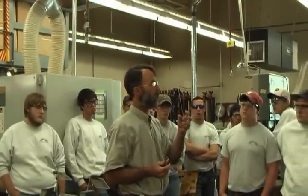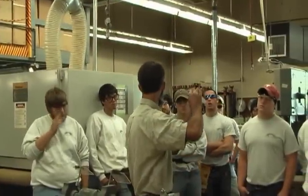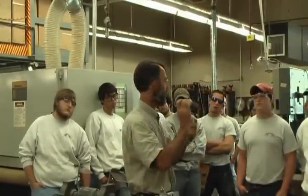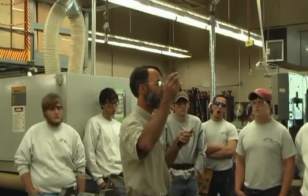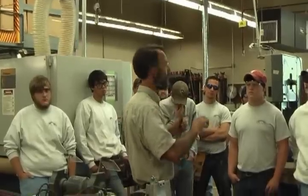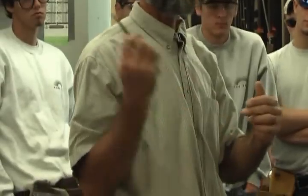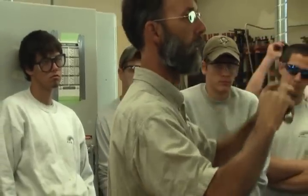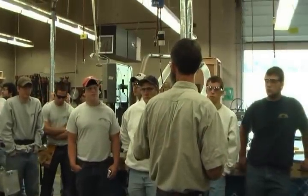In the case of gouges, we took some of this wet or dry paper, glued it to a wooden dowel. And it now became a slip stone that they could sharpen their own gouges. Cost me what? 30 cents or something. So then I got my fifth graders sharpening chisels. First thing I do, picking up a chisel, start feeling the edge. You would say, this one, is there a burr on it? The burr is on this side, right? So we got to take that burr off, and that's how we get to our razor edge.